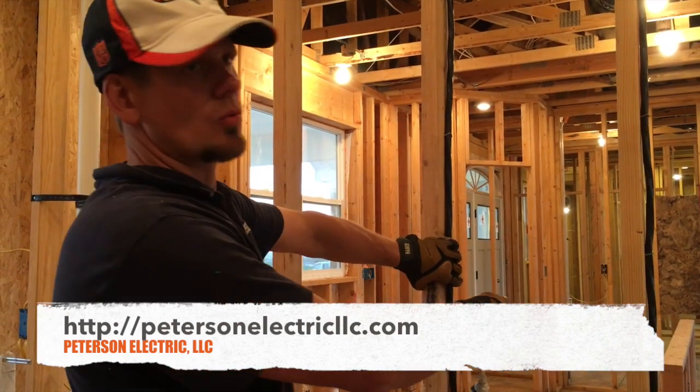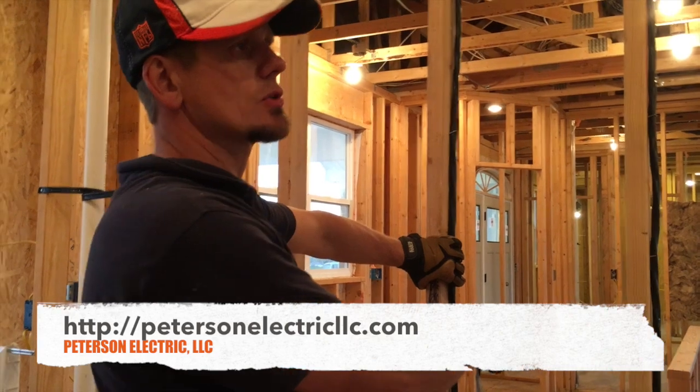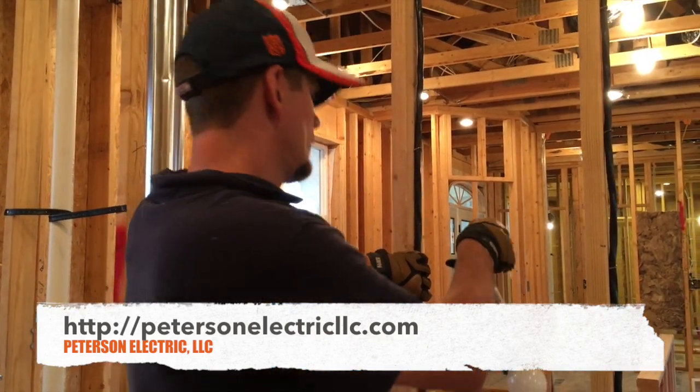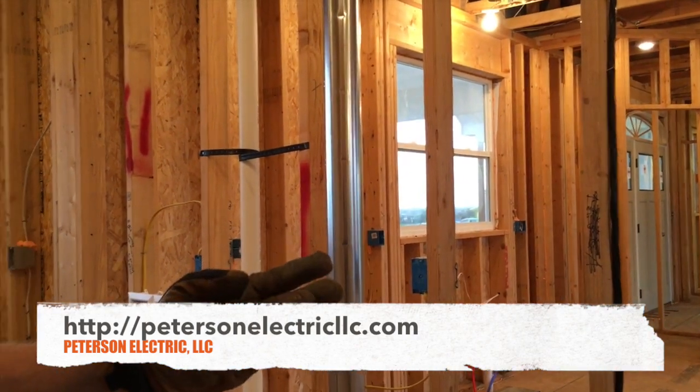I had to repull that — that was wrong. We thought she was going 30 amps but she bought a Viking 36-inch cooktop which was 45 amps, so it has to be six-gauge for the cooktop. Then she also had two sub panels.